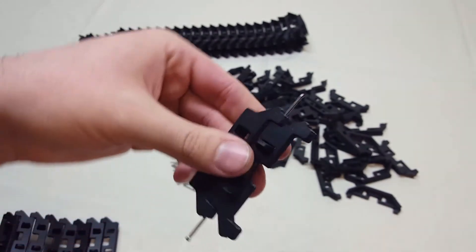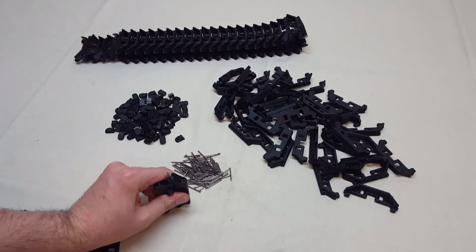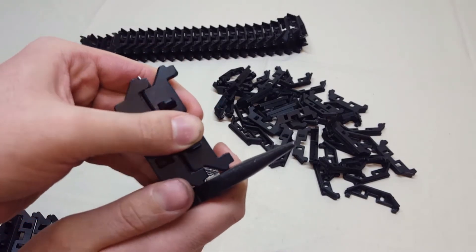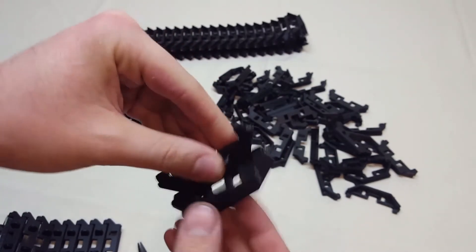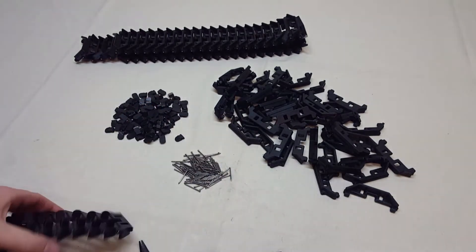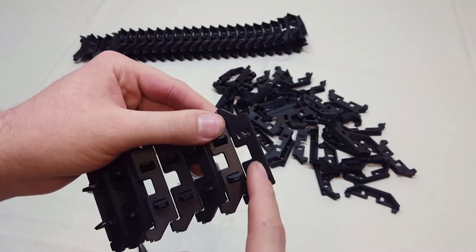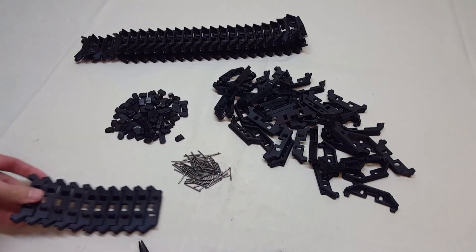I suggest when you start your first link, leave a couple of guide pins out, then use a blank link without inserting pins, and feed a nail in on the ends. Push it a little by hand to keep it from falling out, then push the nail down on the table or use the end of a tool. You don't want to go very tight — leave a little slack so it hinges freely. Leave the two end guide pins out until you finish the track, otherwise you'll keep fighting them since the pins are what hold those pieces on.